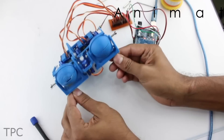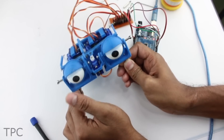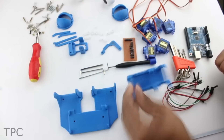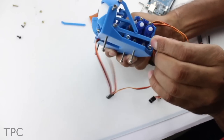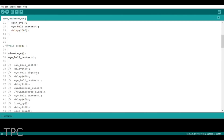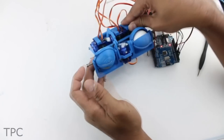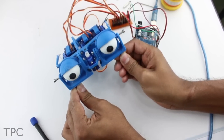Number 5. Doesn't this animatronic eye look real — as if someone is watching you? You can also build this one yourself. It requires some 3D-printed parts and some knowledge of electronics. The movement of the eyes is controlled via motors. Before attaching the servo arms to the eye mechanism, make sure to upload a test code and set the servos to their zero position. After that, the servo arms can be connected and the main code uploaded. Once finished, you will have a real set of animatronic eyes.